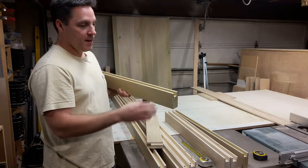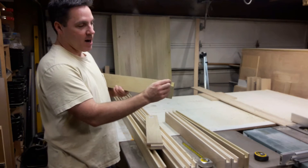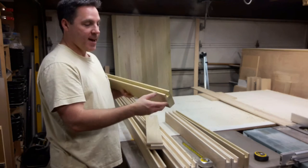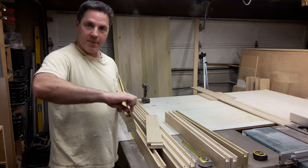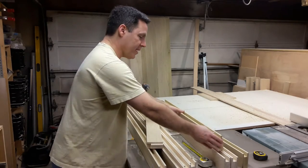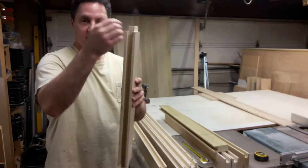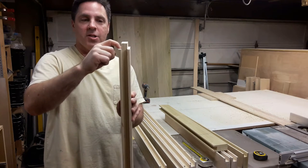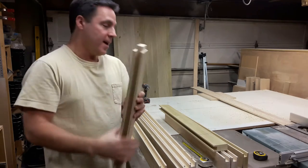All you need to do with your rails is essentially strip off about three quarters of an inch of this end, and you want to make it just deep enough to remove the side pieces that are created — like the walls of the channel. When you do that, you're left with something like this: you still have the channel on the piece, but now the cheeks of the tenon have been pared away so that you've just removed the outside edge of the channel.